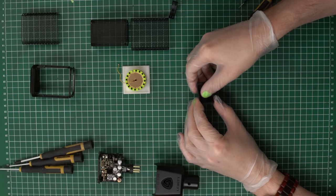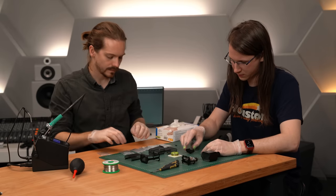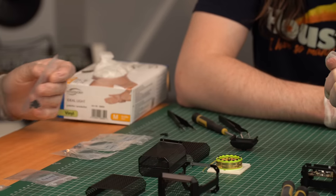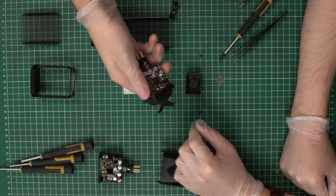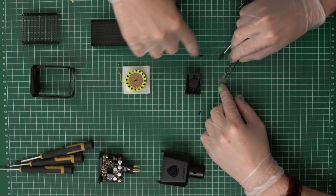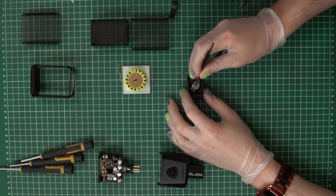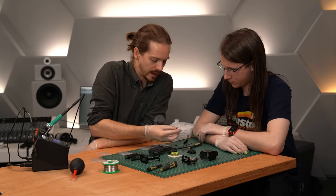There's a key mechanism so the rubber damping component can be dropped in accordingly — it's a relatively tight fit. We often apply some additional damping material — it's not really a glue, it's similar to rubber, but it's a material we apply at the end that takes a long time to cure so we won't do it on camera. Here's what we made earlier, just to show how it might be placed around. Now we drop this ring in to keep everything in place, align with the screw holes, and drop in two screws. Then we can drop in our actual capsule holder that sits on the capsule support — it's locked so it can't really move into the wrong orientation.